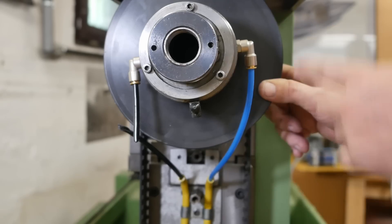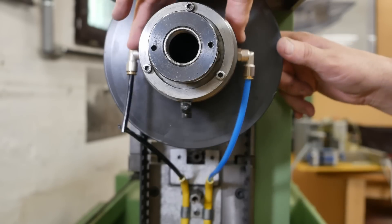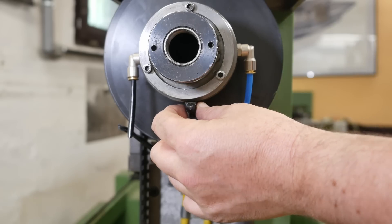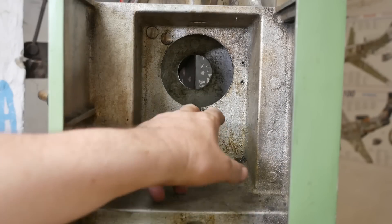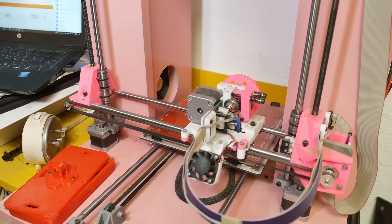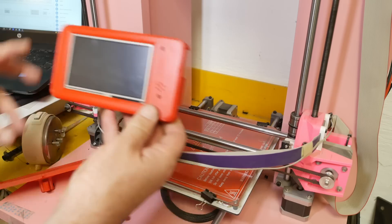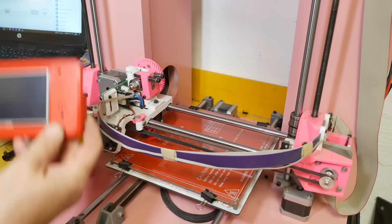There was a little bit of discussion last week about the collet closer's air supply bearing and its anti-rotation feature. Assuming that the tubes were the only anti-rotation feature, but that's not the case — there's a pin down here with a matching feature machined into this back cover casting. So that's the anti-rotation feature there. A big shout out to one of my fantastic Patreons, Jörg. I took my 3D printer around to his place the other day and he helped diagnose what the problem was, so now it's communicating with me again. Jörg also gave me this five inch monitor so that I can monitor the status of my printer. Thanks very much Jörg.